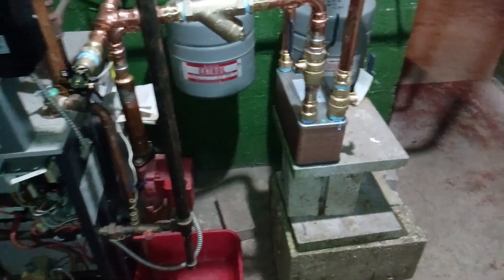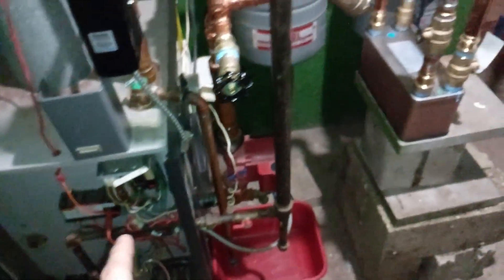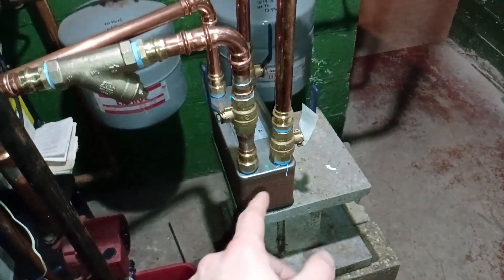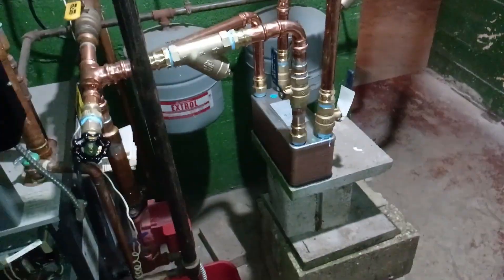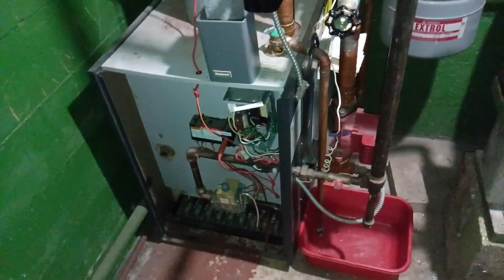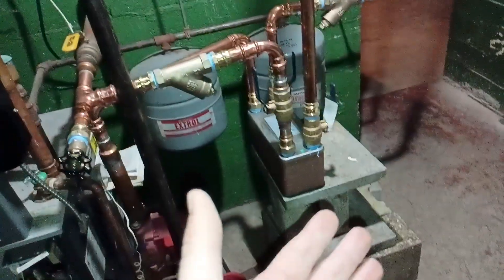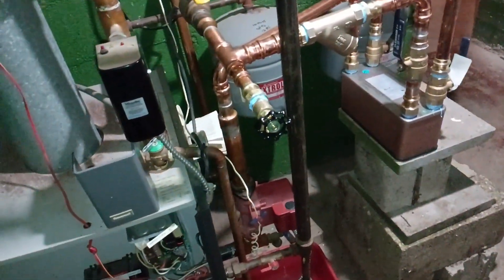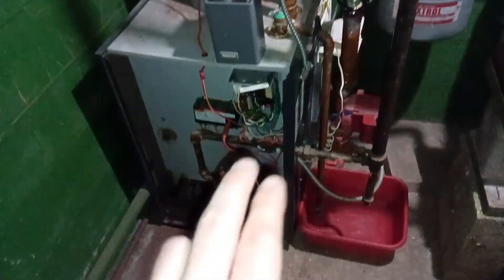As long as the pump is still running and the existing boiler kicks on, we're heating up the heat exchanger, which then heats the water going out. But that would be very inefficient — we don't want to be heating water to some minimal level and passing it through the outdoor boiler. We also don't want to destroy that outdoor boiler, so it works both ways. Really, we want the existing boiler to kick on at a lower temperature, and that can be done.